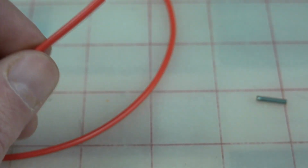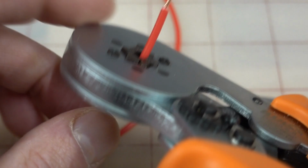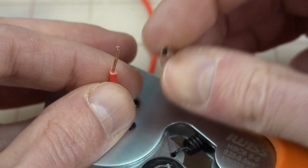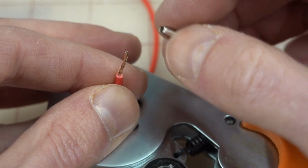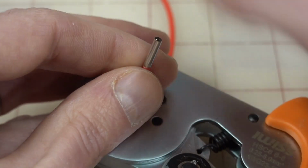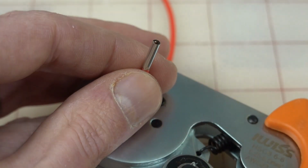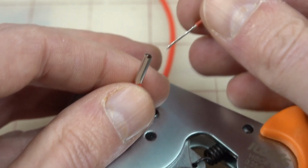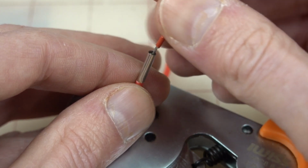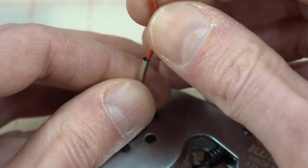And then I'm going to slide my crimpers on here, and then I'm going to put my wire connector on here. We're going to put the squared off crimpety end up the big wire, because when we have to fight the second wire in there, we want to have it as simple as possible. So we make sure the second wire is a red one. We just work that in gently and all the way down.